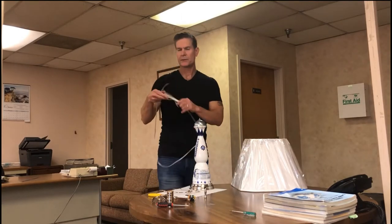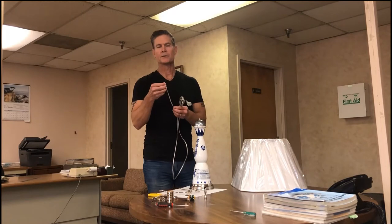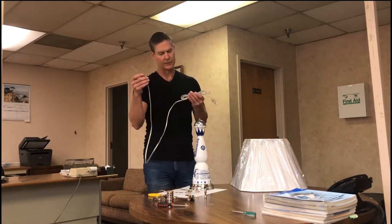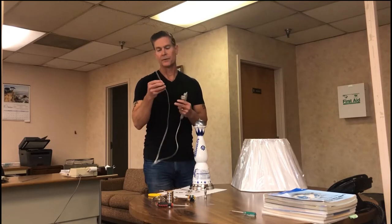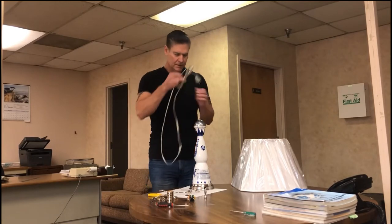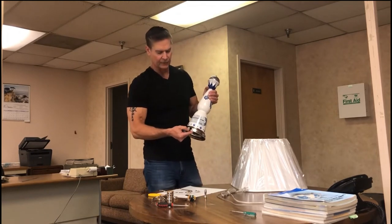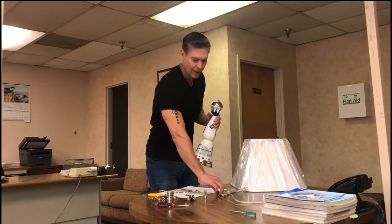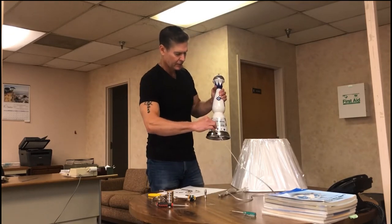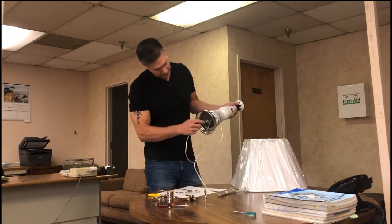I'm going to take the cord. This is a silver transparent cord — it's an 18 gauge 2-conductor, SPT1 with thinner plastic coating. Kirk's Lane sells lots of these. I've already put a black plastic bushing in the side of the base, which protects the cord from getting chafed and causing a problem. So the cord goes through there and then up the center pipe.